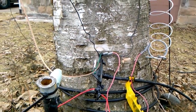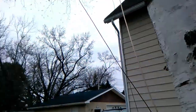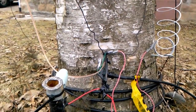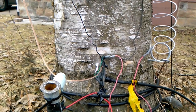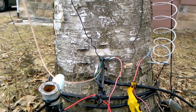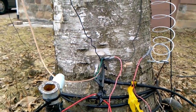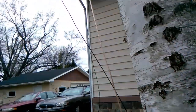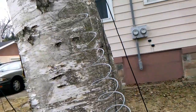I was able to get higher up into the tree — I'm not going to show you the whole length because it gets lost up in the branches. A neighbor came over with an extension ladder and helped me get higher into the tree, so the vertical portion is now about 30 feet up in the air and the horizontal is over 50 feet long. I've also decided to turn this into a fan vertical, so this wire here is the 20-meter element and this wire here is for 17 meters.